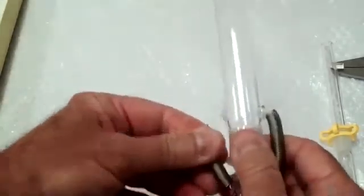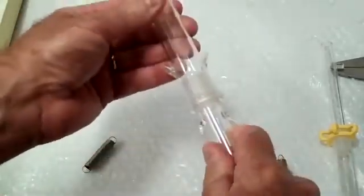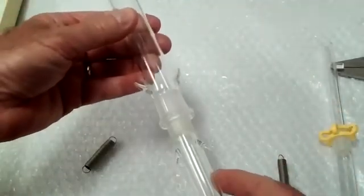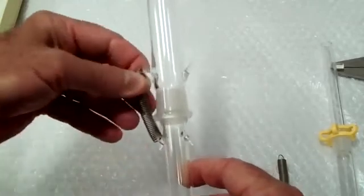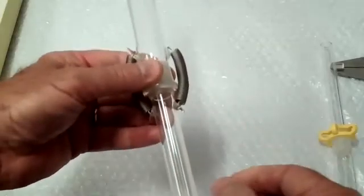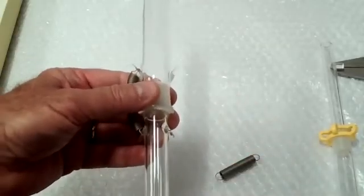There is another method, which is kind of old school. The glassblower will put glass hooks on each connection in such a position that they fit together, and then with wire or in this case springs, you put that on to hold it together. This method does not get affected by temperature. Just have to be careful in handling — occasionally these get bumped and they snap off.